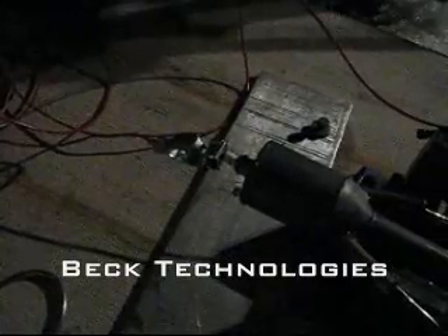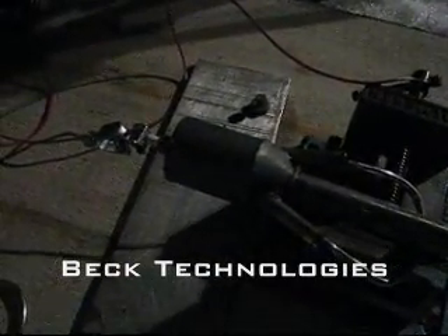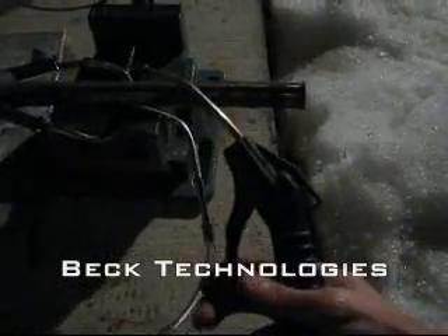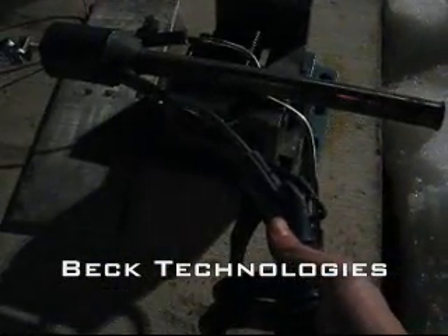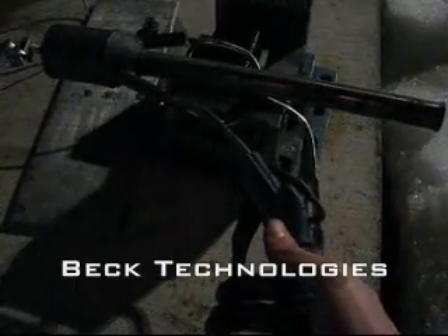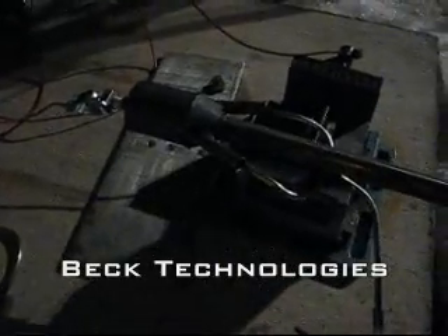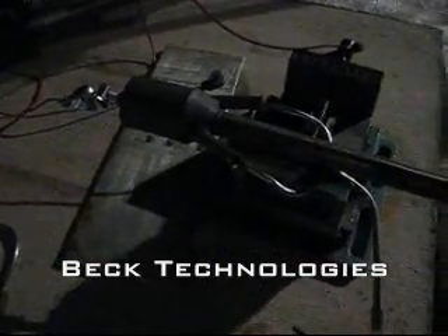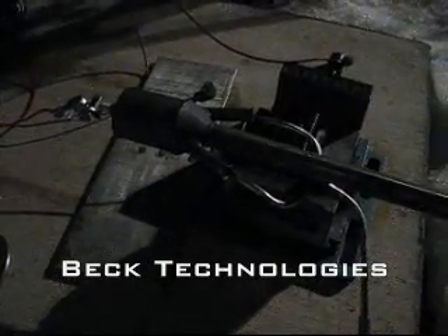There's a little spark plug in the combustion chamber. When you go to start it, you just turn on the ignition source and take your compressed air blow gun and position it in the intake, gently blowing in air. As soon as you start blowing in air, crack the fuel open a little bit and it should make some pops and bangs and start right up.